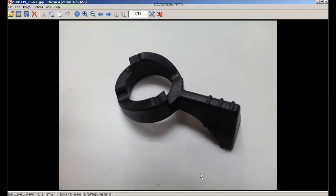So when we unwrap it, we know the pattern of it, so we draw the pattern, then we wrap it around the cylinder, so we can form this kind of geometry. The idea is that we know the diameter, so you must draw the profile, the pattern. The total length of this pattern is the perimeter of the cylinder, where perimeter is what, pi times the diameter.